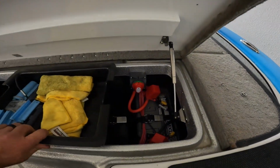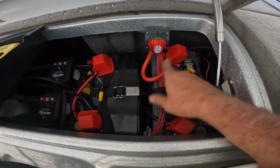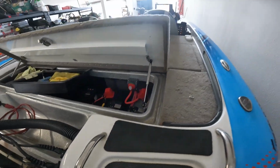This is what I did in the back. Put a disconnect switch right here. Go into my starting battery, so it's got dedicated power directly from the battery. A harness is pre-made to fit your boat for each graph and module that you have. So Sonar Pros makes it very simple for you to hook these things up. They use high quality components. Everything's got the nylon sleeve over it, so it pulls through the boat really easy. I'm kind of surprised how simple it was to do this.